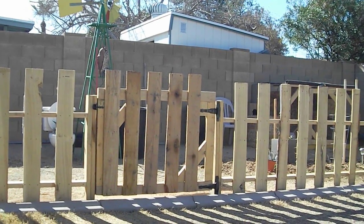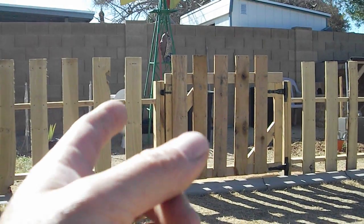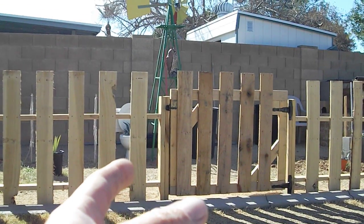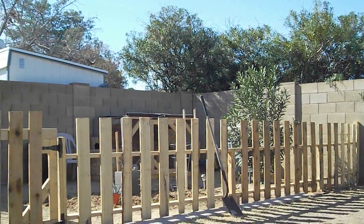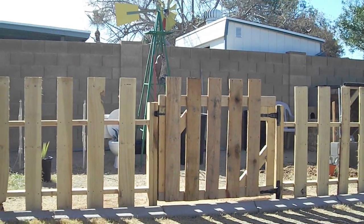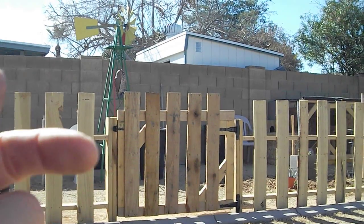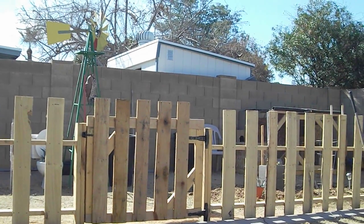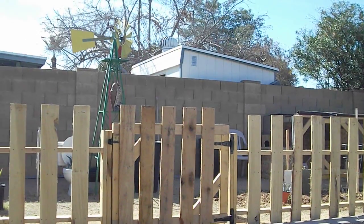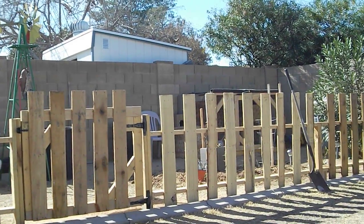Mine's more decorative as well as just to keep the two areas separate. Some of the pickets up here are pine. The center one I found from a good hardwood pallet made for outdoors — maple or oak or something. One thing I can recommend on all the pallet pickets: drill pilot holes and use screws. I set my electric drill to a torque setting. If you didn't drive the pilot hole through, they would have a tendency to crack. Pallets are usually made out of crappy material or seconds.